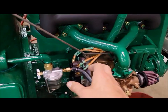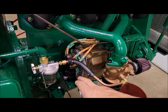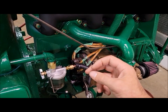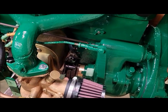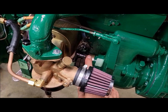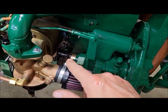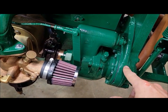and then took the magneto, took the cap off, put the rotor to number one, and in direction of engine rotation, turned the coupler until the magneto points were just starting to open for number one. And then wherever we marked that on the coupler, on the mag and everything, and then wherever that coupler was located, we took the governor back off the engine and turned that tang to match those couplers, and then retimed that gear to the timing gears in the engine.